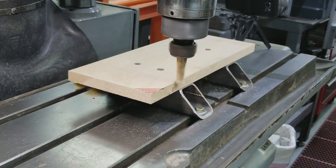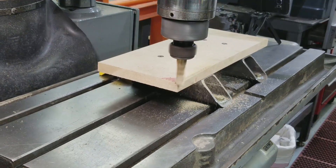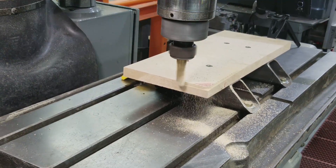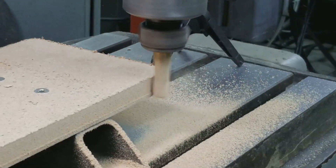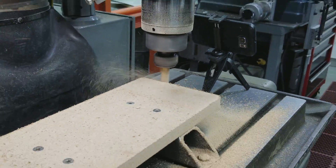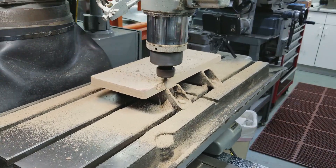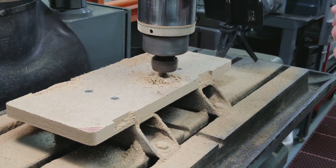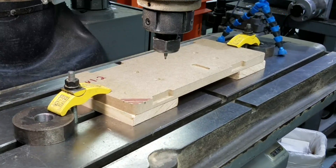Because I only had one piece of magnesium to work with, I had to start out by using a piece of three-quarter inch MDF, or medium density fiberboard, to do a couple of test copies of this plate to make sure that I had all the machining operations right and that I didn't have any mistakes in the dimensions. I left two operations as manual operations after the automatic machining: the first was chamfering the holes that hold the plate to the blower case, and the second was the finished tapping of the holes that hold the carburetors to the plate.